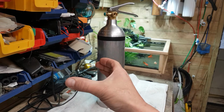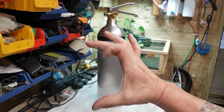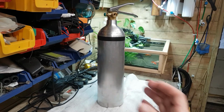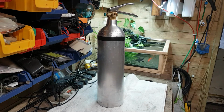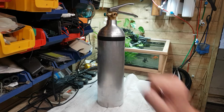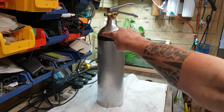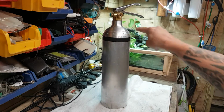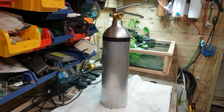We're going to have to make a little cap, cut a little disc to fit under the bottom, because these are only tubes when they come, so we're going to have to cut a round piece of acrylic, which I've got lots of little bits kicking around here, and we can make one and glue it into the bottom, and then hopefully we'll have a little bit more that'll slot on the top like that, and that will give us our little lip around there, then it will slot back on, okay, so it won't come off.